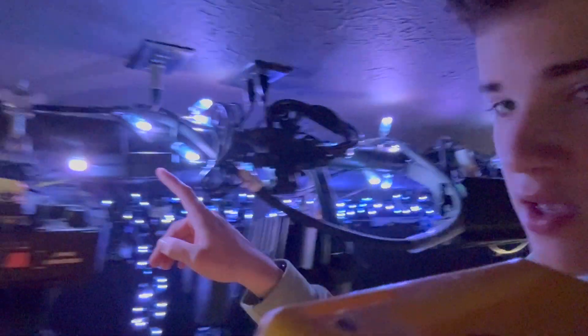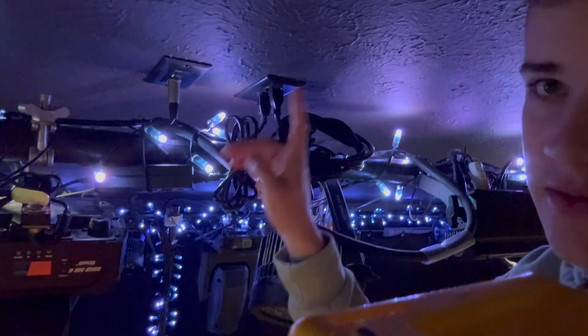On this side I'm wrapping the strips fully around the bar, which looks a lot better than just tying them up. I'm now up on a ladder — I spliced the strip, putting 25 LEDs on as an extension. I also wired in a power supply that is directly injecting power through the end of the strip.